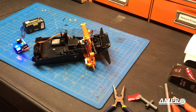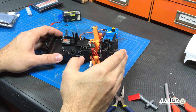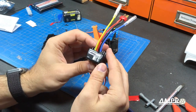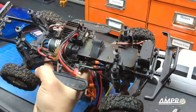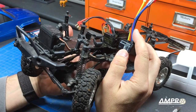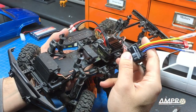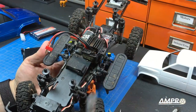I think we need to put an ESC in now. My goal with this truck is to use these same 9.6 volt battery packs, and because of that I would need a speed control capable of greater than 7.2 volts — therefore I bought this. This is a 3S brushed speed control. It's probably very overkill for this application, but nevertheless — WP1040. Wait, I've seen this before. Thunder Tiger, Toyota Hilux — this is the 1:12 scale car. It has the same part number, this WP1040 brushed, but it doesn't say crawler on it. This is nothing more than a contract manufacturer designing these speed controls and then somebody installing a custom decal — in this case, Thunder Tiger. This has actually been a very good ESC, so I'm glad to see this.